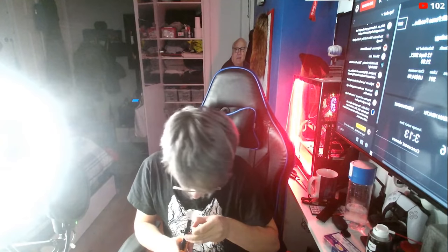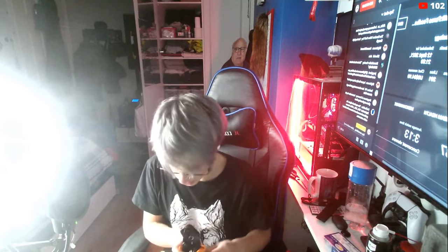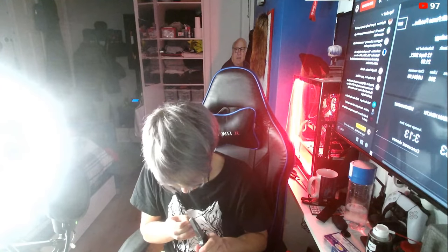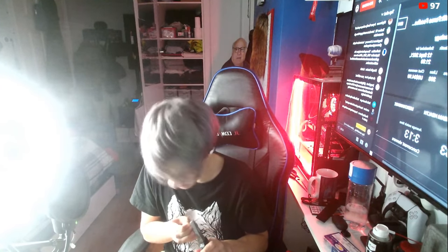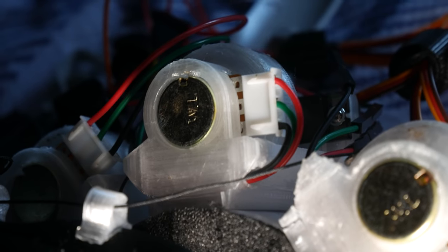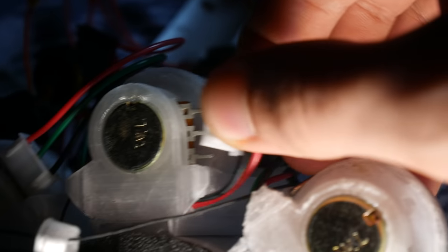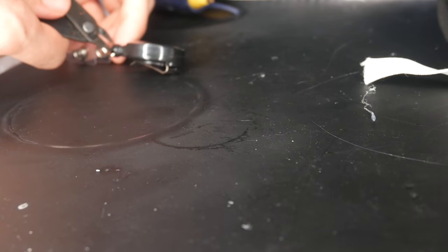Once you've realized what you're doing is wrong, make your JST connectors properly. Crimping is an incredibly painful and hard process, at least for me, so please follow a tutorial online on how to crimp. Once you've learned, crimp all your wires and put your JST connectors on them. These are five-pin JST connectors, and they slide perfectly onto the potentiometers — which is ideal.